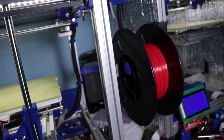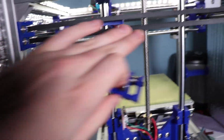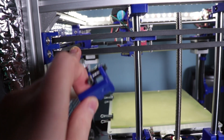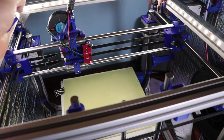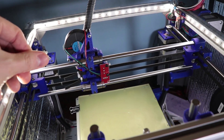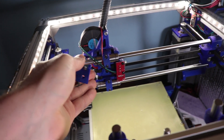Here's the other side. I'm going to use an identical model but flip it 180 degrees so it tensions the bottom belt instead of the top belt, so I'll have both sides tensioned. It's just pushing the belt out about a centimeter which will tighten it up. Now, when you tension belts in a Core XY setup, one side will skew towards the front and one towards the back. In the old system I'd have to notch the belts, get them super tight, and make sure both had correct tension for the gantry to be straight — that was the biggest pain point.